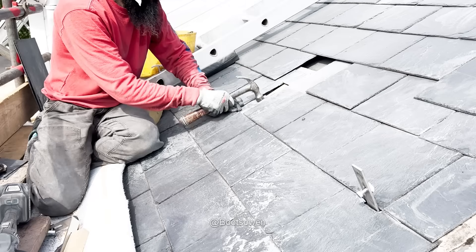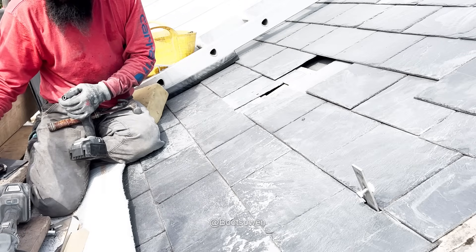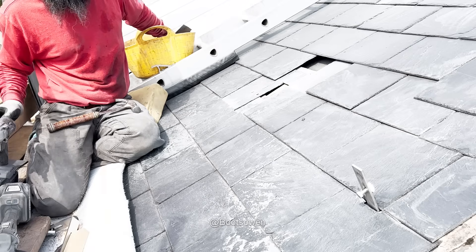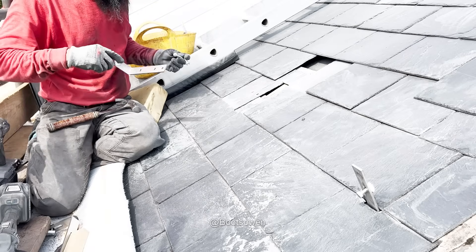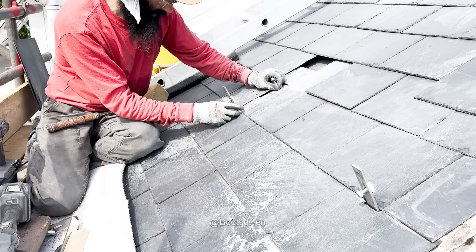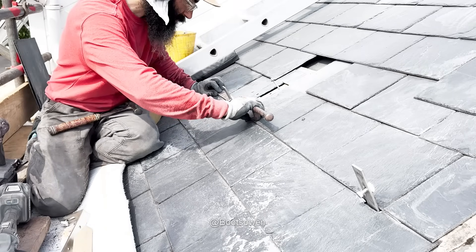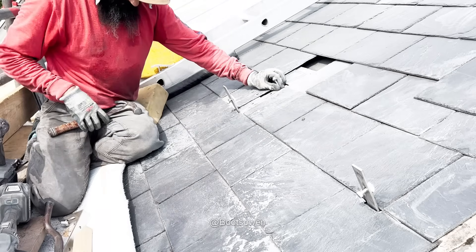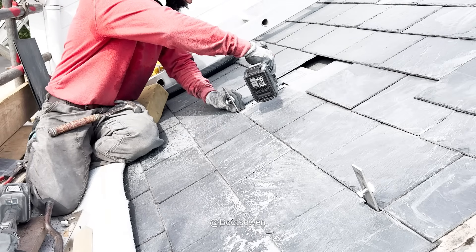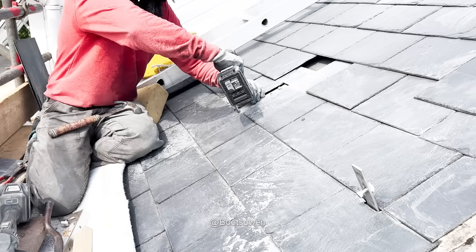I'm nailing that off — that's a bit of a belt-and-braces approach because we're going to screw through it anyway for the bracket. I've put a bit of a divot in it just so it sits down and I'm not tearing through it when I screw down the bracket. Just dress it in with the hammer roughly — not even sure if you have to do that, but I was nervous I'd shear the lead and the roof wouldn't be waterproof. The top hole I'll screw in first, then the bottom hole as well. We're flashed up to that bottom hole using the lead, and above it. This is the impact driver — an Aldi product, no affiliation, but they're cheap and they really do work for intermittent jobs.